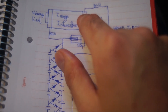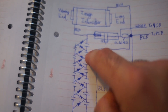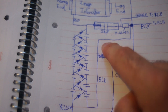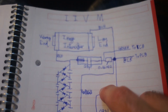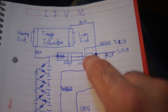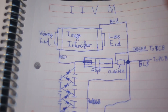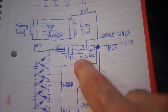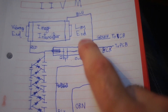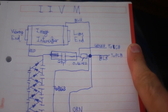It also tails off to a whole load of other parts. The other side, which is the yellow, goes straight into the voltage multiplier circuit, which goes all the way up here. Another part of it links back round, so this is basically paralleled to the transformer. What I suspect this part of the circuit is for — as well as creating a voltage potential difference between these two points — is that the green and black wires go to the PCB and are paralleled across a 0.46 megaohm resistor.